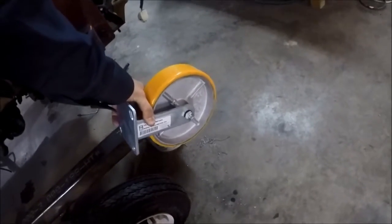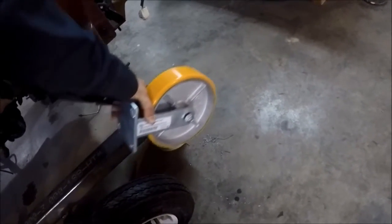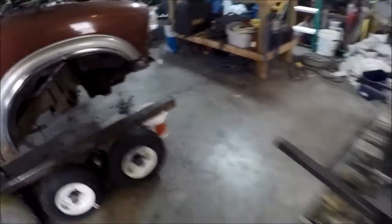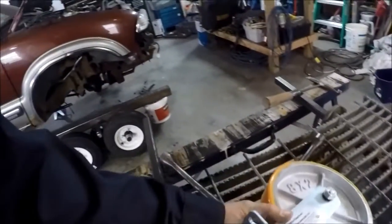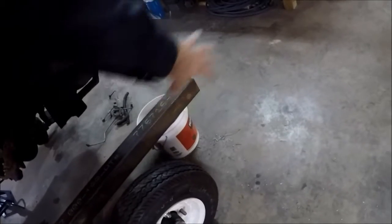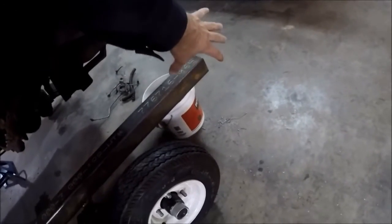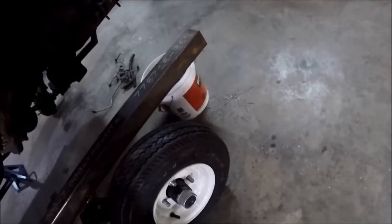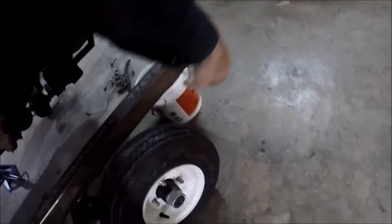This will move in and out — I'm going to spring-load it. I've got some springs from some pressure regulators from when he used to rebuild instrumentation. That idler wheel will sit here and tension in and out. The front spot will be higher so that if you go over anything big, it'll take some of the weight until the tires catch.